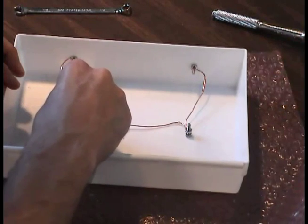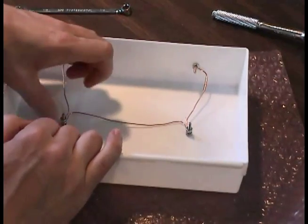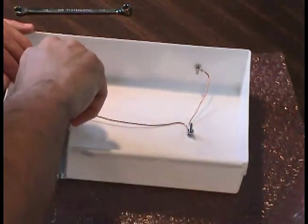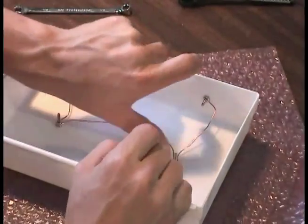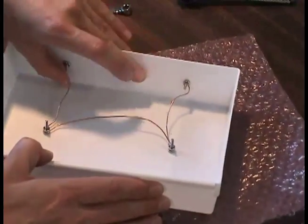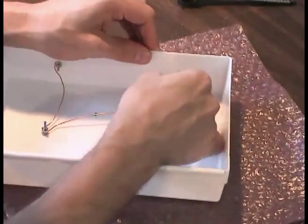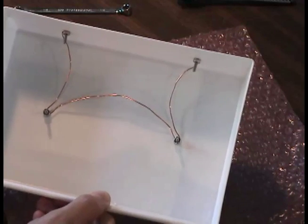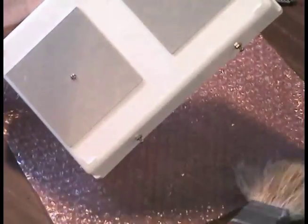This thing goes together really, really fast — it's just a piece of wire going through four little nuts and bolts. And if you've got a quarter-inch ratchet with the deep socket, the length of those bolts don't become an issue. When I'm done I just do this thing to make it look good — I make this arch. I just like things to look good, so I pretty it up so it looks more like it's going to do something for you instead of just being gangly wires. That's how you make a zap plate.